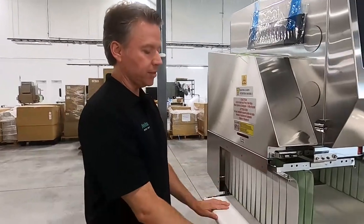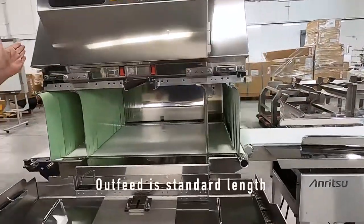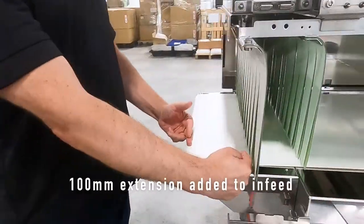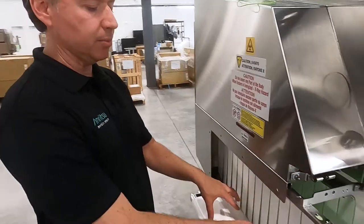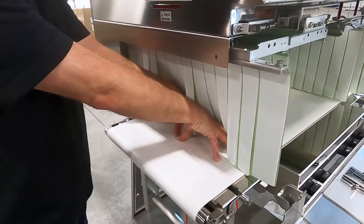We are focusing just here on the infeed side of the system. If you scan back here for a second, you're going to see that the outfeed side of the system is the standard length. All of our XR75s come standard with an 800 millimeter length. This one, however, we added an extra 100 millimeters just on the infeed side, and that helps with smaller products. So as the product transfers on, it becomes stable onto the infeed of the X-ray, and then it passes through the curtains.